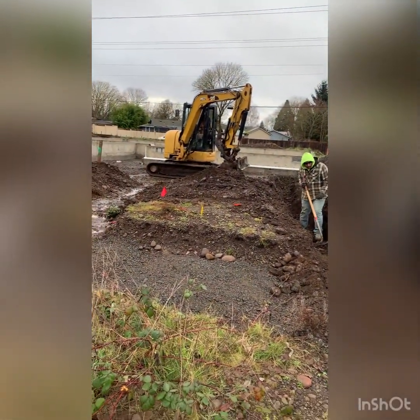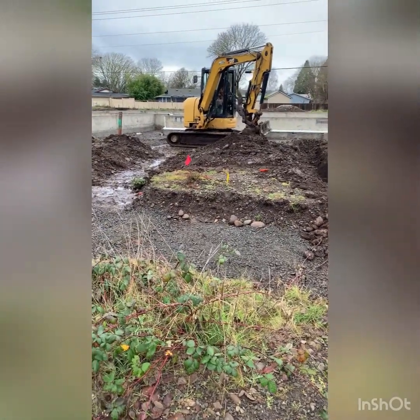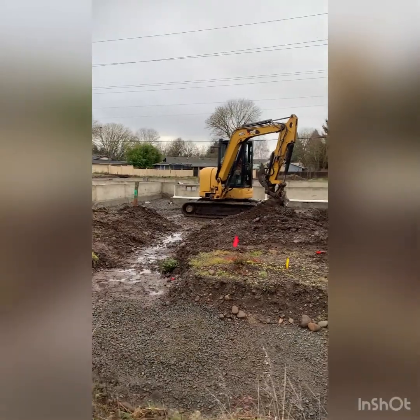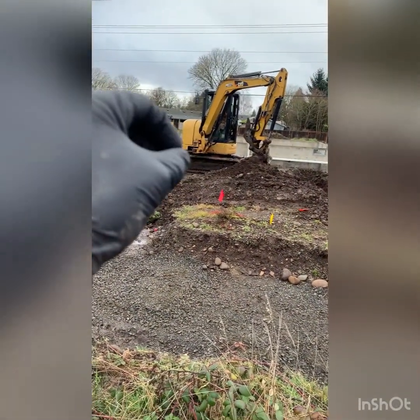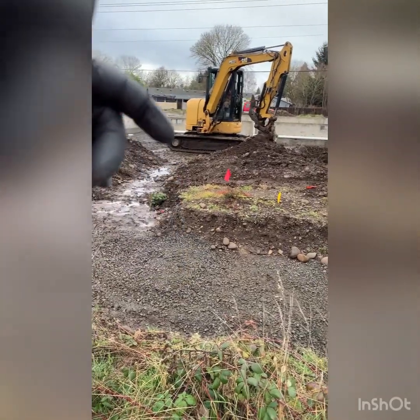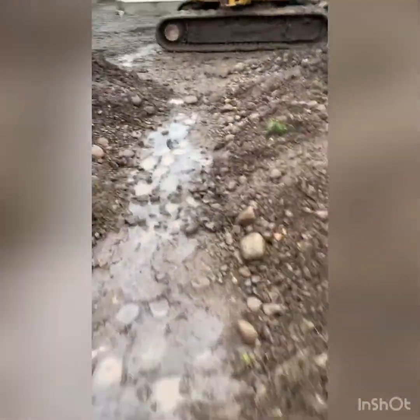So there's a weep hole. Move out through the curb. Right about the front of my track is maybe where the low point is of the house. All the water from this dig out, it all comes down to about where my machine is, one area. So if water gets under the house, it has a place to escape. We'll pipe it out to here, latch onto that one, and there's that one. So let's go ahead and start digging that.